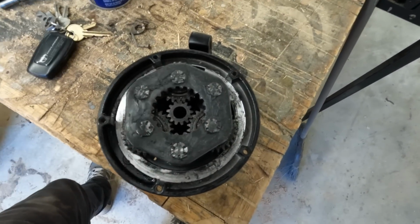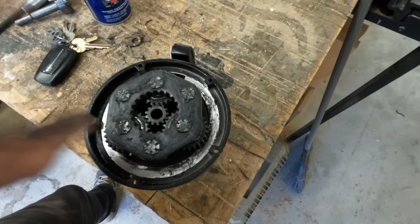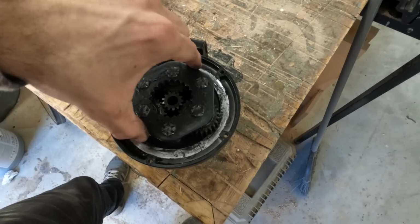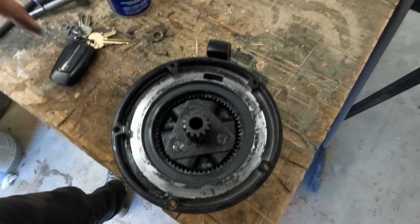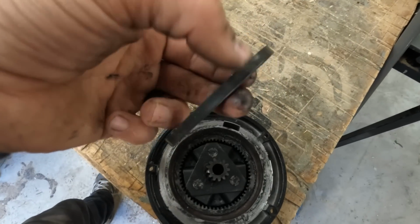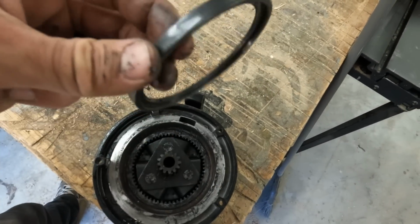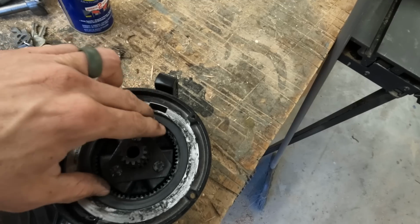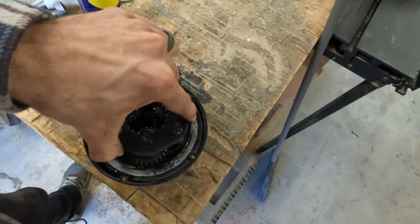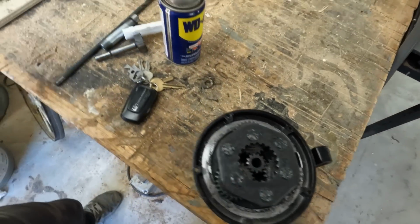And the reason is when you assemble this whole case, these gears will shift up, they'll shake up and down like 3/16 of an inch back and forth. And the reason for that is because this dude is worn out. I can feel a burr on the end of it. I can see some wear. You see that plastic hanging off? I guess that over time, this dude riding on it, just like this, friction has worn it down.